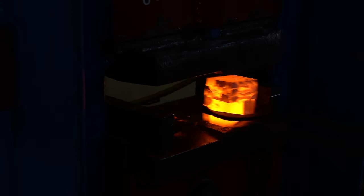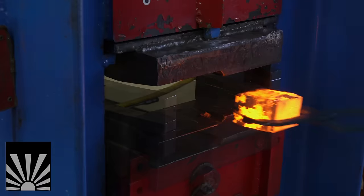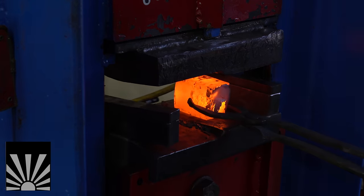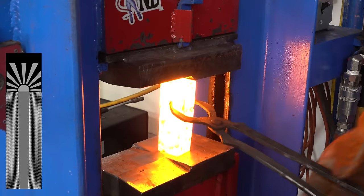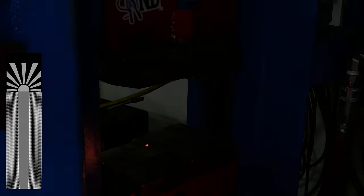Rick and I decided we wanted extra steel on top of the sun to use as the tang, because we didn't want to deform any of the rays. So here we're forge-welding some extra steel on top. And now, finally, our last forge weld — we're forging the sunset to the ocean. It's a very tricky weld going horizontal and vertical at the same time.